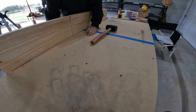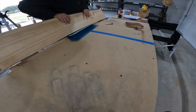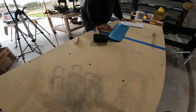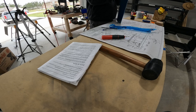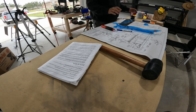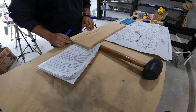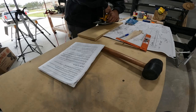The trim tab, just like all of the trailing edges on the RV-8 empennage, has a folded trailing edge. The first thing to do is get that bend, which is pretty easy on such a small part. We're going to do the folded closeouts like we tried to do on the elevator, but this time it's going to work out a lot better. You can see I've got some MDF, a little template, and I'm going to create the bending block.